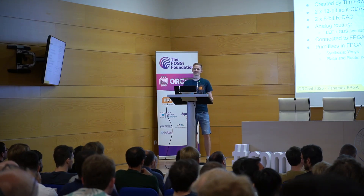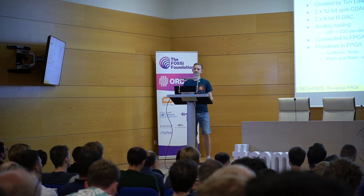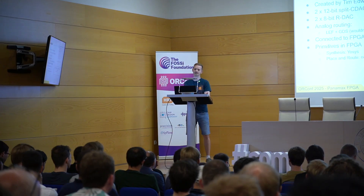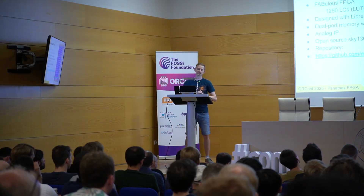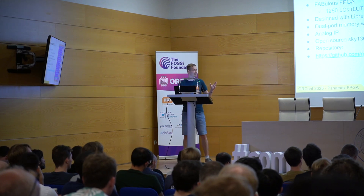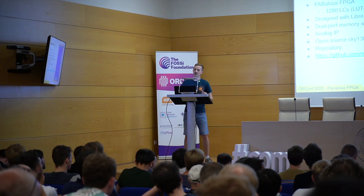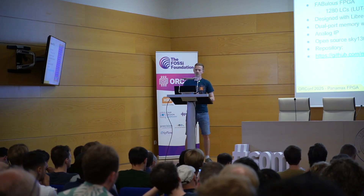A question about comparing the design between Sky130 and the IHP PDK in terms of PPA. What I noticed is that when I started with Greyhound, the density in Sky130 was actually higher — I could make smaller tiles. However, with the latest updates in the IHP PDK, with the reworked standard cells and new routing directions, that has also improved considerably. A direct comparison is difficult because the Panamax FPGA architecture is slightly different from Greyhound's — I removed some CLB multiplexers to get higher density and a higher CLB count — but I would say they're rather similar.